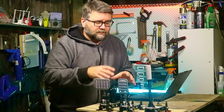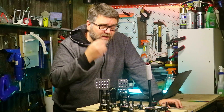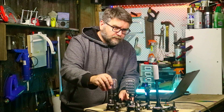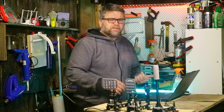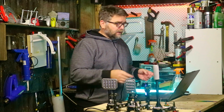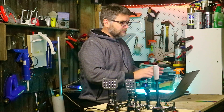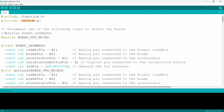Because the sensitivity is quite different from what your computer expects, we need to calibrate the pedals in situ. You push the button, move the pedals back and forth, and it stores the calibration in the controller's memory, so when you take these pedals to any computer they'll just work straight away. Once your pedals are lined up and the sensor light comes on and off as expected, it's time to hook it up to the computer and upload the firmware. The sketch comes with the download along with the STLs and the guide, and it's made for both the Leonardo and the Pro Micro — the only thing you need to change is in the top few lines of the code where you put a double slash in front of the board you're not using.